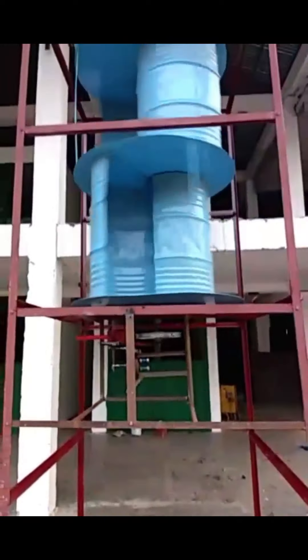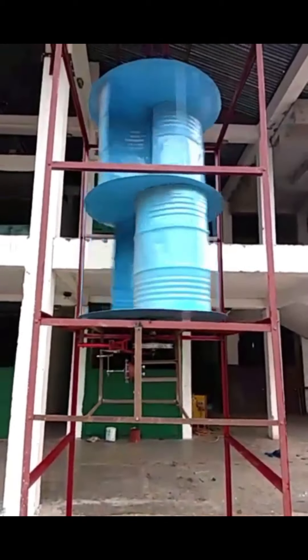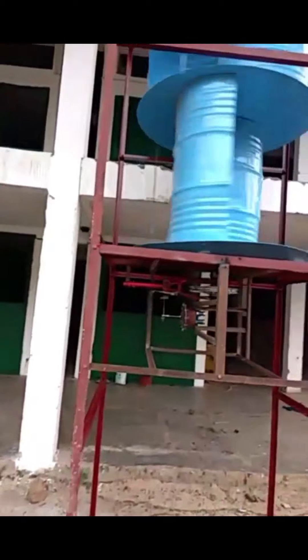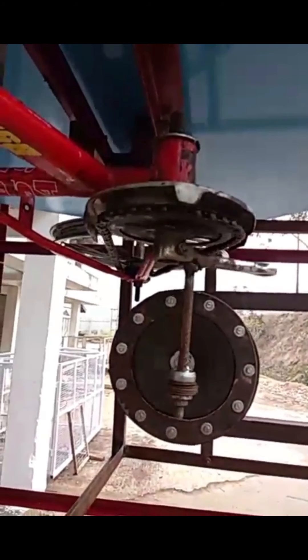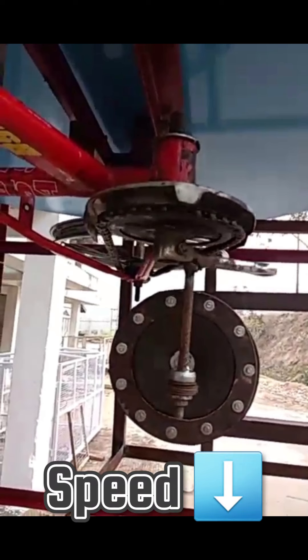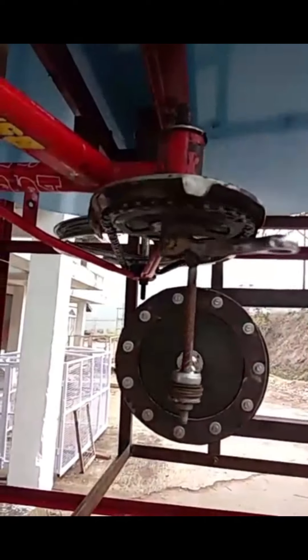Let's have a look at how the wind pump system works in motion — everything seems to be running like clockwork. Now let's look at the gearing: I have reversed it and made the smaller gear moving the bigger gear. This reduces speed but increases torque, because the diaphragm pump requires higher torque.